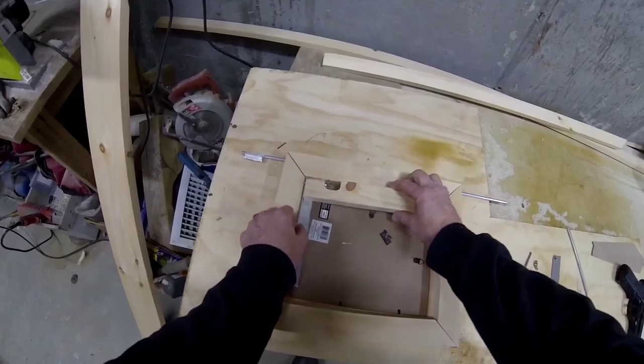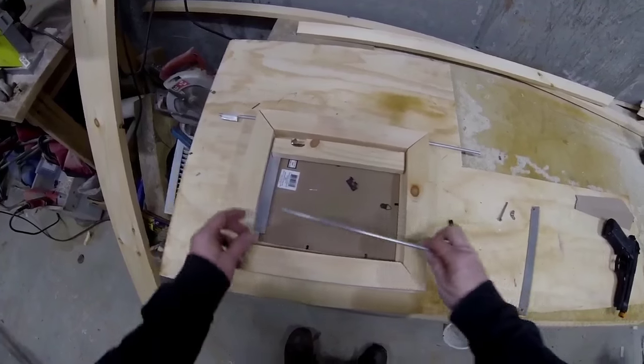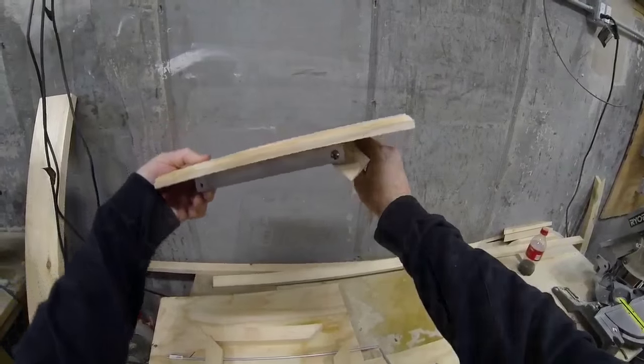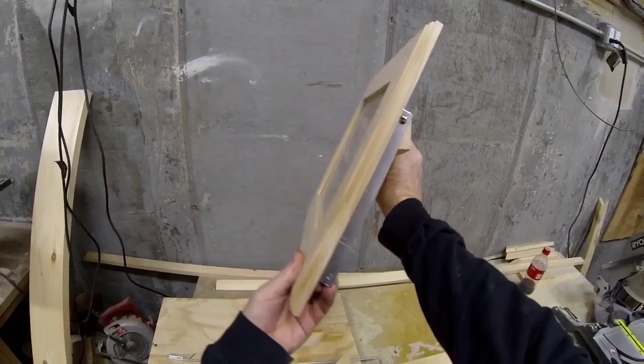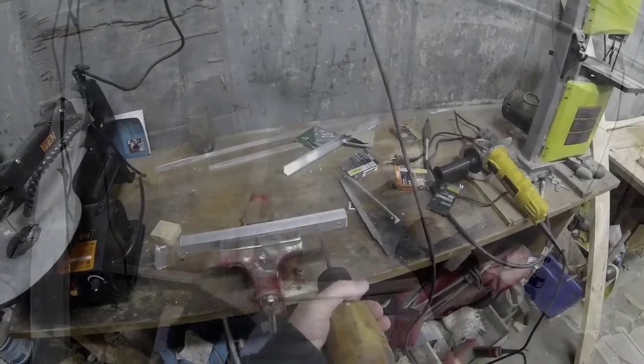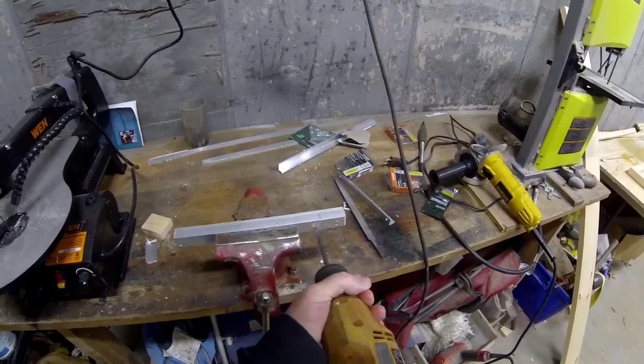We're going to make a swing arm. It's got a couple of components — a cross member at the top made out of wood, just a one by two, two side pieces made out of aluminum angle iron, and a shaft on the bottom. This design allows the bracket to be mounted to the wall, with the picture pivoting away and then also pivoting in the opposite direction.